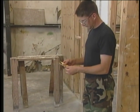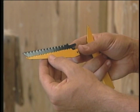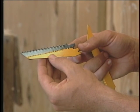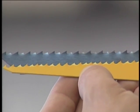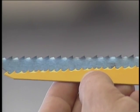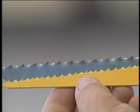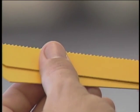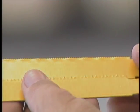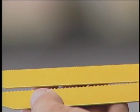Its blades range in length from 2.5 to 18 inches long. There are two types of blades, carbon steel and high speed. Carbon steel blades can cut wood, fiberboard, asphalt, aluminum, embedded nails, and similar materials. The high speed blades cut metals of various thickness, conduit, channel, hard rubber, and fiberboard.